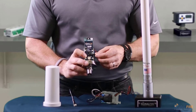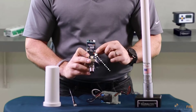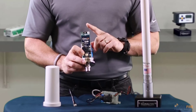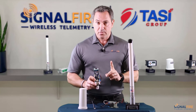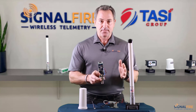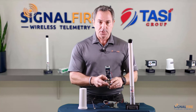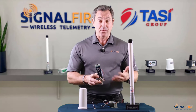Let's configure it. First, plug in the battery and you'll notice the light will start blinking fast — an indication that the pressure scout is searching for a gateway. One last important thing before moving to the software is proximity between the antenna and the gateway. If they're too close, you will have problems connecting because the signal is essentially too loud.